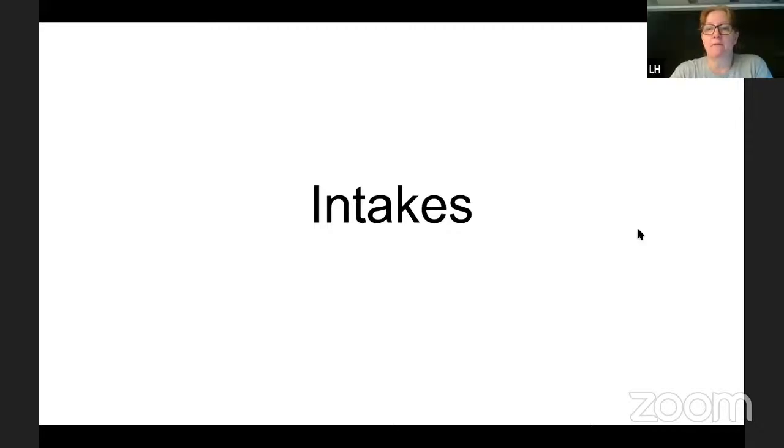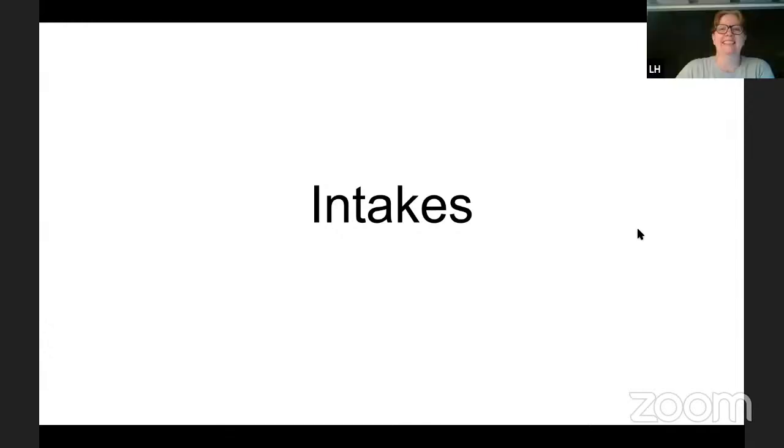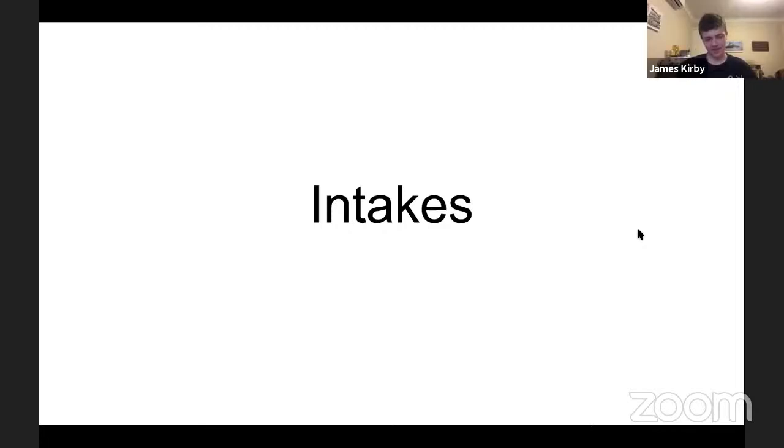Excellent. We have one more question at the moment, and this is any pros and cons for wire versus rope for elevators? Right, that is definitely one for debate. Wire can have a higher tensile strength for the size of it, and often doesn't stretch as much if you use it right. The disadvantage is that you can't do really sharp bends. You have to use larger radius pulleys to slowly turn it around to a different orientation.